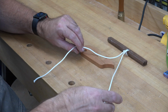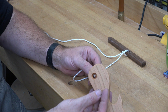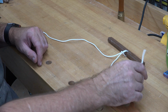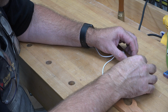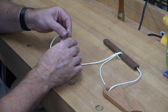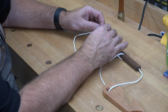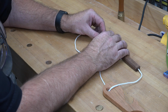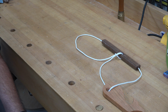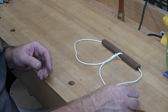So now the piece on the right will get put up through the whale's eye, just like this, and it will get glued into the hole on the right hand side of our stick. This left hand piece of 1/8 diameter rope will come around and get glued into the left-hand hole in our 3/4 inch wide block. And once you get that done, the puzzle is assembled. So, off camera, I'm going to assemble mine, and this is it for the project, guys.